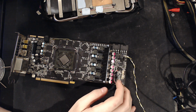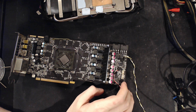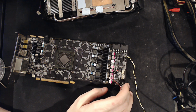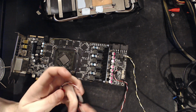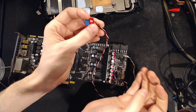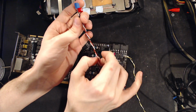Personally, when you have a soldering iron and a datasheet, it's so much easier to do a volt mod than try to figure out how to get the stupid software to do what you want, that often I'll just go with the volt mod. And this card is very much a case of that, as you can clearly see. So the volt mod is my usual style of volt mod. I do my volt mods a little bit different from everybody else.